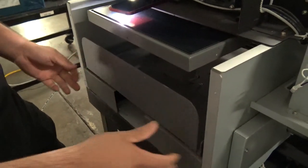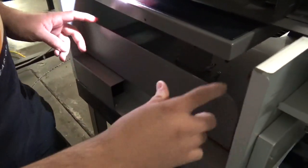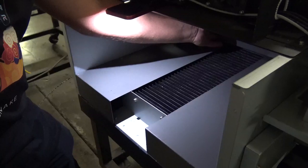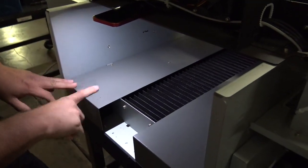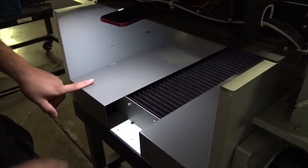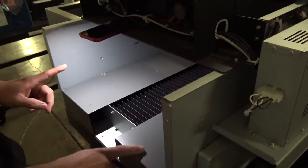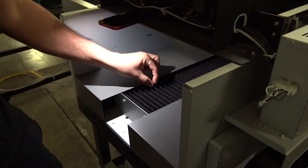Okay, so the next day, we're going to turn the machine back on without the covers, just to make sure that we don't have the PF motor error. If you're still getting that PF motor error, then we need to push the table towards the front of the machine. We might need to remove these covers back here, and this part right here might need to get replaced or cleaned out a little better. Okay, so first we're going to try that. In our next video, we're going to show you guys how to remove these covers and how to remove this bellows right here, in case we're still getting the PF motor error.